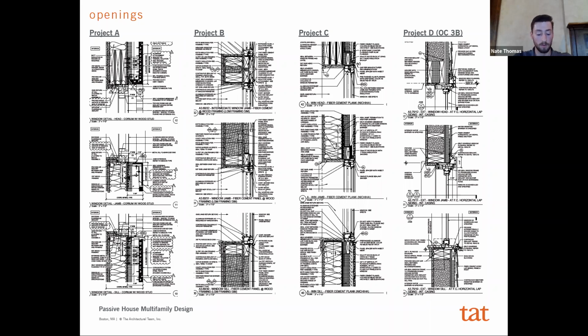You have to have U values of approximately 0.17 or lower in this area, so it's a pretty low U value, and a very airtight window. So mainly triple pane, casement awning windows will be what you're looking at. And we've had other projects which use that, but the focus on a passive house job, particularly with this, really eliminating thermal bridge component, is how do we install these windows and the detail for the window installation itself.